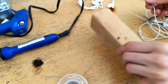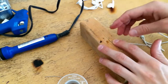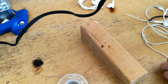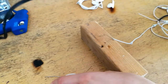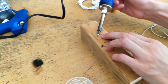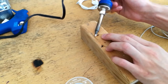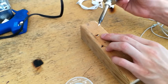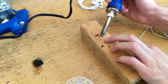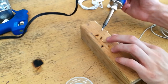So here we go. To strip the enamel you can either use the knife and board, or what I found quite effective is you can just force the soldering iron onto the conductor until the enamel finally melts. First clean the tip of your iron, set the conductor in a location where you can work on it easily, and pre-wet the tip of your iron slightly. Now hold the wire down and basically just let the soldering iron burn away all the enamel — let it char the wood underneath a little bit — and pull it away gradually to leave a nicely tinned section of wire. Do the same for the other side, refreshing your solder if the flux has dried up.